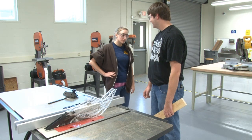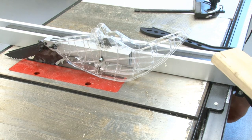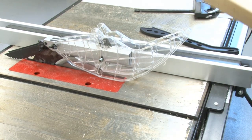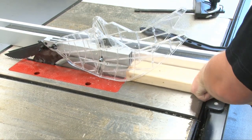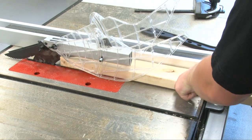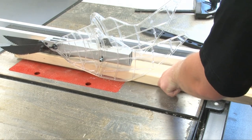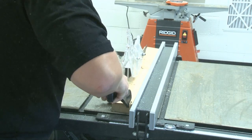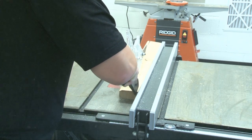Let's go talk to the teacher. Hand placement is still important — if the stock you're working with is three inches or less, you will use a push stick to keep your hands away from danger. Also make sure you stand to the side of your stock and not directly behind the blade, so you are out of the line of fire if a kickback happens. Make sure the guard is installed; it has grippers that will prevent kickback and will help prevent you from getting your fingers in the blade.